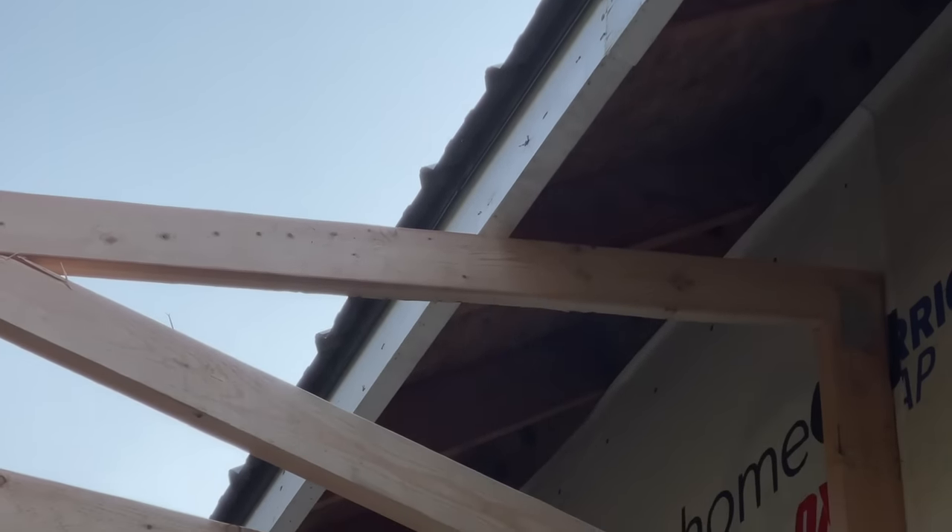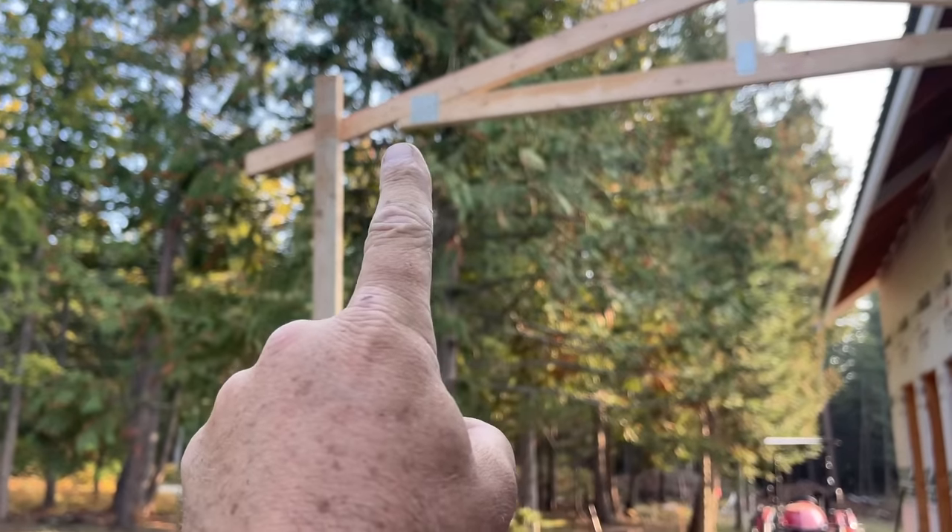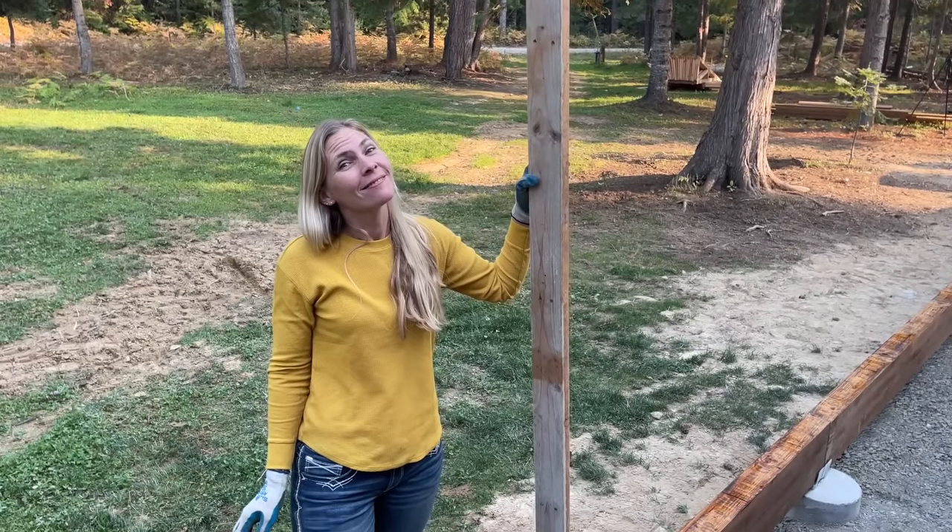So that's the look we're going for right there. The problem is there's not enough space up here for the sheathing and the roofing to fit up underneath, so we're going to have to lower it down. I wanted the ceiling right at eight feet but it's going to be more like seven ten. We're going to do a little fine-tuning. We've got our support holding it up, we measure from here straight down to there, and that's how tall our post has to be.